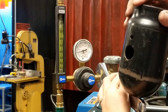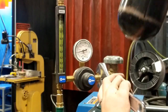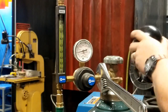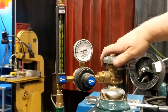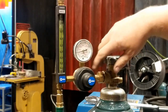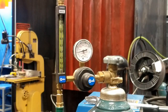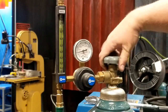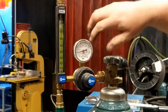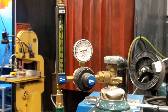We're not beating this on like a fool — just assisting it slightly. I'll give that a little bit extra, then come back in 10 minutes. I'm going to open the valve to make sure it's full of gas, then close it and come back. Ten minutes later — since the camera didn't move you can probably tell the needle didn't either. I'm going to open the valve, and now I know there are no leaks in this setup. I'm going to open this all the way up and hook up the gas line.